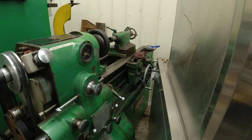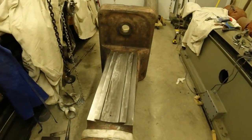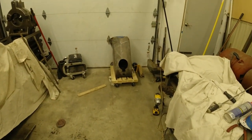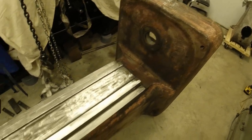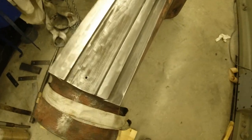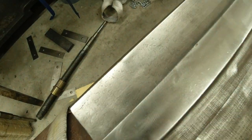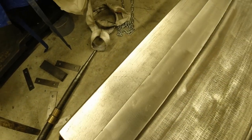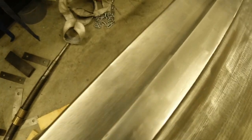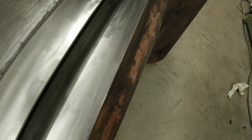And in that vein, my Bridgeport project, that was just going to be a simple throw some parts in it and get it going, has turned into a monster. There's the knee over there. I laid this down on the back so I can measure these. As you can see right here, you can see some of the frosting up here. These are little oil pockets and are generally 0.2 of a thousand deep, give or take, depending on who did them. You can see them all the way down that side and into this area, then it starts to rub a little.